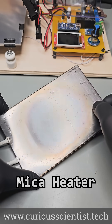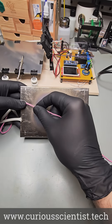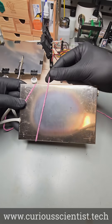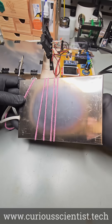I use a so-called Mica heater, which is a much faster heater and it can reach higher temperatures than those PTC heaters. These heaters are based on a silicate mineral called Mica. They have excellent insulating properties. So inside these stainless steel jackets, there is a thin Mica sheet, which has a thin heating wire wrapped around it, as I illustrate in the clip.